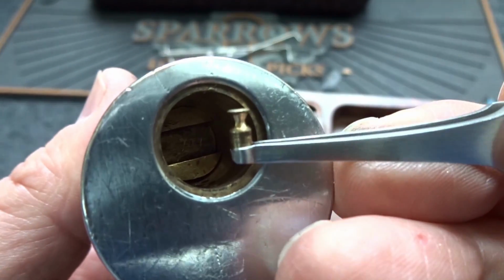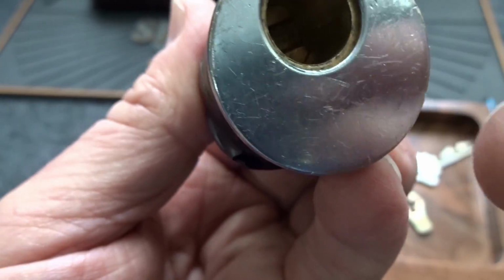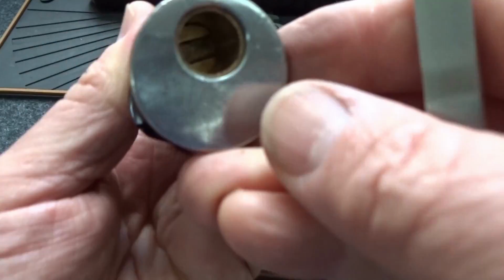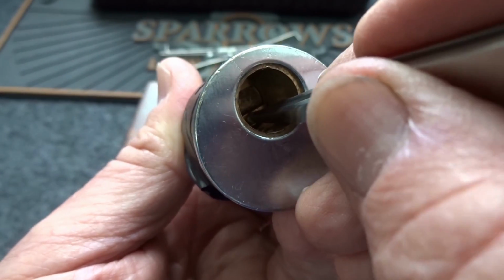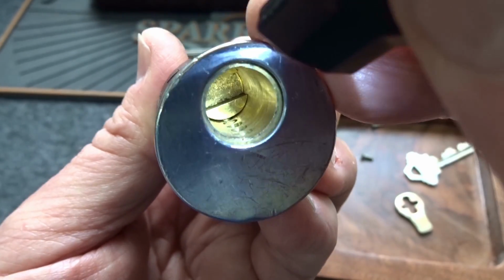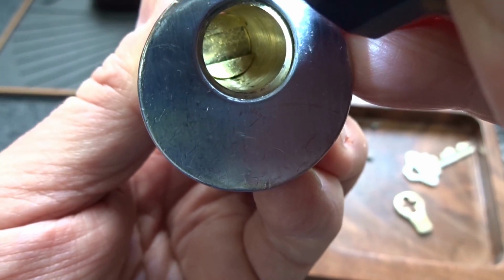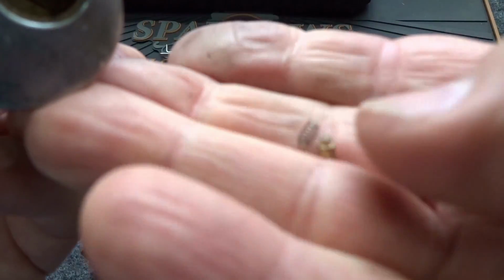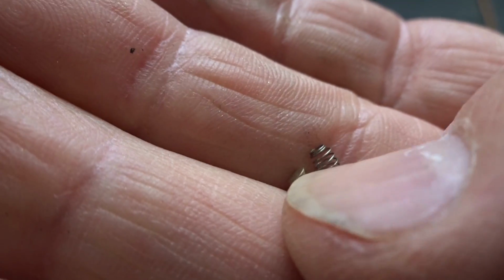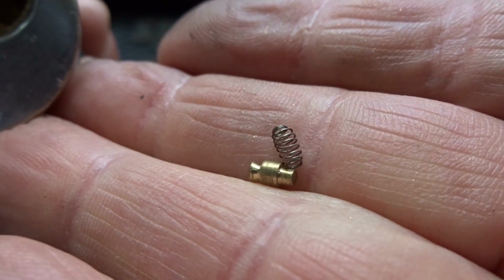Number 3, another homemade, very sharp edges. Remember that was undercut, as was this one. Okay. Spring, nothing. He's not coming out. All right, let's just move on to 4. Okay, I'm looking at 4 and nothing popped out. He's there, but he's absolutely flush with the top. I think you can see him there. Look, probably another wafer. Nope. It is a T-pin. The angled part was pointing up and the T-pin was pointed towards that baby spring.